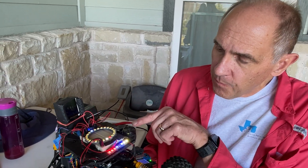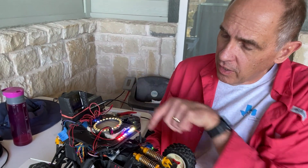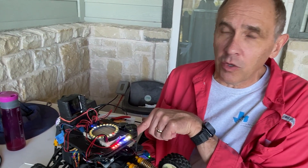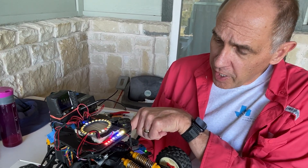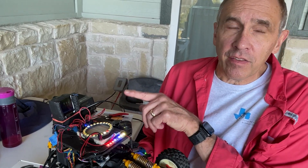Everything runs on a 20-millisecond interrupt loop. The asynchronous serial output gets stomped on about 0.2% of the time, resulting in bad packets. When that happens, if I had a cone detected but receive a bad packet, I use the sample from the prior period — and the next packet comes in clean again.